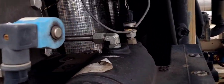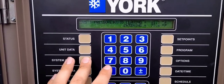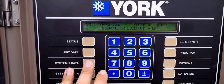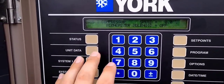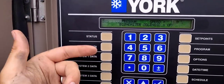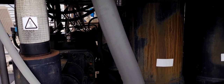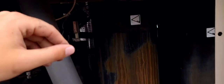From the main panel you can see different readings. Under System 1 data, the economizer solenoid is shown as off — that is the valve I was referring to. Like I said, this will be off for the first few minutes of the cycle and then will turn on, at which point it starts to pull flash gas off the top of the flash tank. There is also a liquid level sensor monitoring the liquid level inside the economizer, and that is also displayed on the panel.